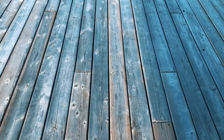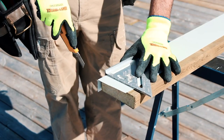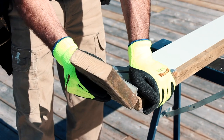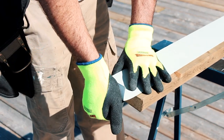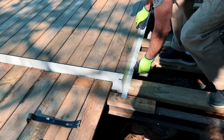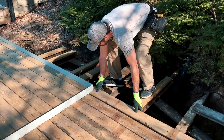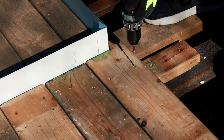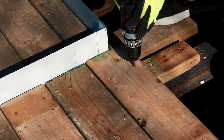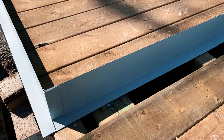Now, because we're building the shed on an existing dock structure, our foundation is essentially completed for us. To prepare the site, I've gone ahead and cut away the decking surrounding the dock shed perimeter. That allowed me to apply an L flashing to the entire perimeter of the shed, which will prevent water from penetrating the shed subfloor. Not only will this extend the life of the shed, but it'll provide easy deck removal in the future when the deck boards need replacing.